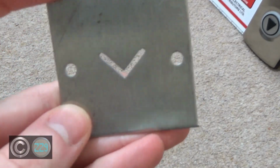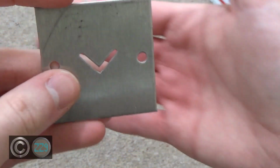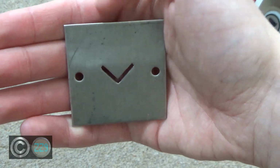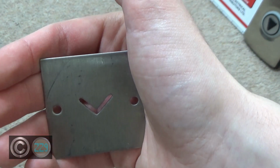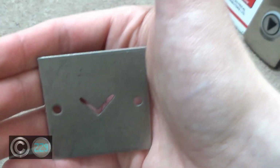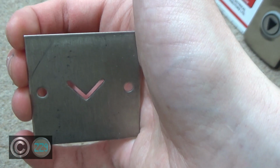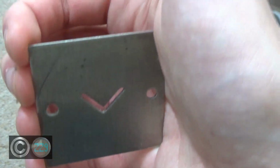Alright, here we have the Otis V shape for the shaft door. In a real lift, you just find this slapped on the shaft door. You put in the V key, and you can use that to unlock the shaft door. Of course, V key, very synonymous with old Otis, so you get a lot of them from, let's think, 60s? 70s? 70s and older that we'd have this. I don't know exactly when triangle became the norm, but I guess it'd be the 70s or 60s and anything older than that. Can't remember exactly. Again, someone will probably let me know at some point.